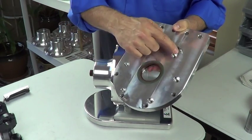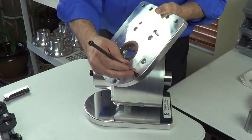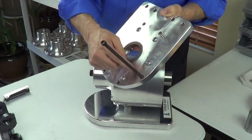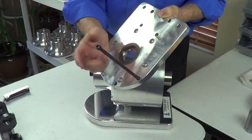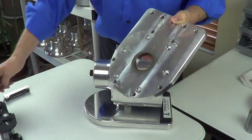You'll see also six steel inserts. So when we tighten this unit down, we're not pulling against aluminum threads. When we're torquing these to spec, we're pulling against these steel inserts — very strong.